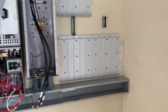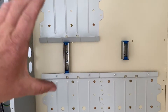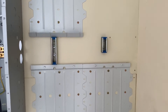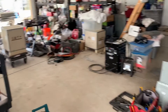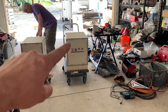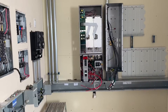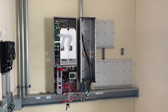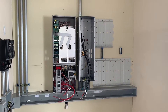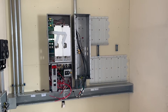We're going to go at the batteries next. We got them all super secured. I have the conduits made right here, but I'm going to actually put the batteries in without them there because it's complex enough as it is. The way that we get the batteries in is we have a hydraulic cart, and we actually put the first battery on top of this crate to lift it up high enough to clear up in there. They actually go in pretty easily. So if you're putting in these types of batteries, one of those carts from Harbor Freight is a necessity. It's a 200-pound battery.